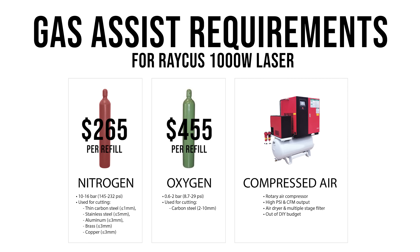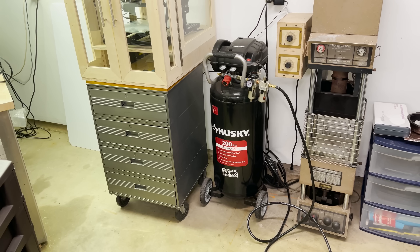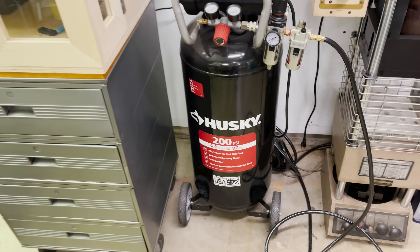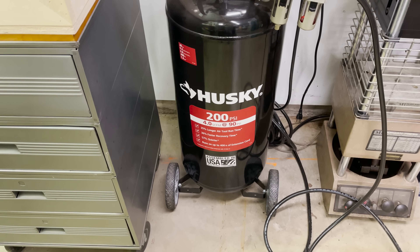The oxygen is going to last much longer. So I'm actually going to experiment with an air compressor that I have. It has a very low output, but it's capable of 200 psi. So I'm going to see if I can get away with using it for some very short cuts — for a part that only lasts maybe 20 or 30 seconds or something.